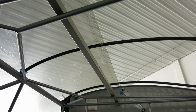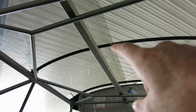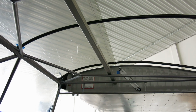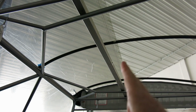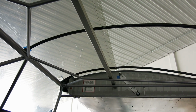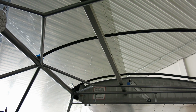And you can see that cross tube where those notches fit over the ribs. It's super tight on those ribs, and so it scrapes the paint right off the ribs when you put it on there. So we'll have to touch that up if it's visible. But like I said, we're moving this cross brace forward just a little bit, so we're going to have to trim off a little bit of that windshield. Gonna measure that up, make sure we're cutting off the right amount, and see where we get.